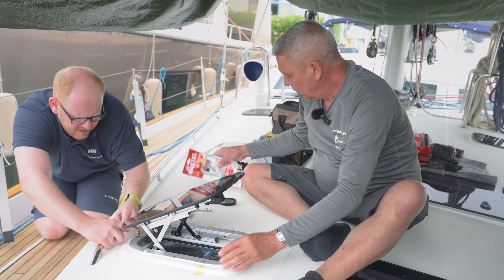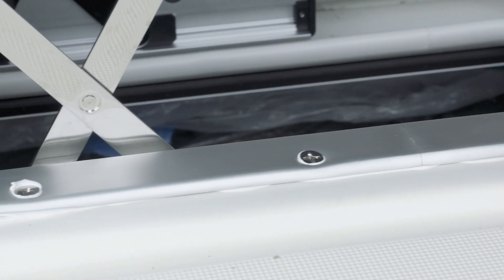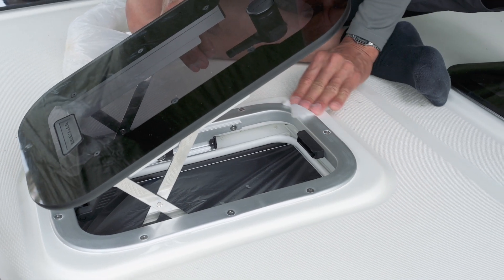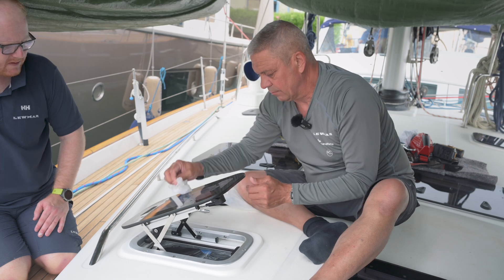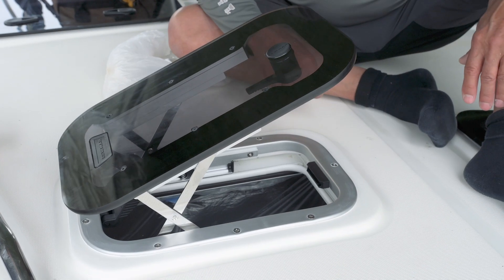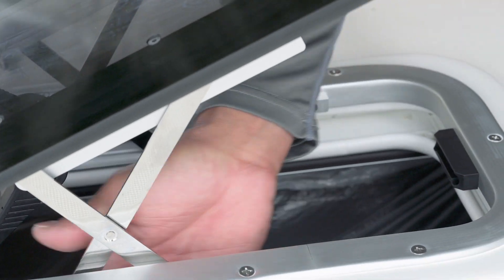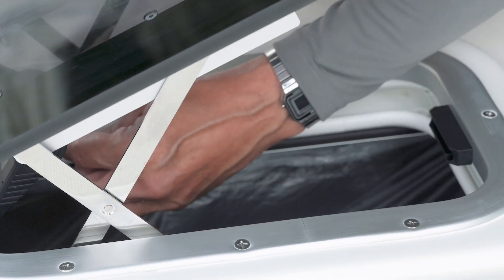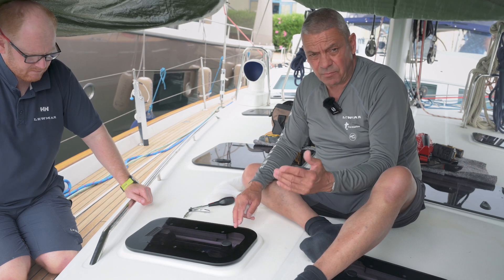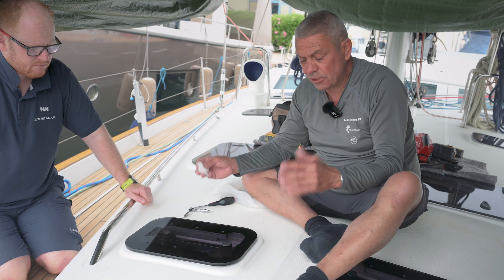Now it's just a case of cleaning up. We're using a generic isopropyl wipe to clean up the excess. You can see that on the screw holes it's oozing out through, which gives you a barrier between the frame and the stainless steel screw. The installation's complete — frame clean-up's good. Check inside, as the hinge that hangs down can sometimes catch the silicone as you go through, so it's prudent to give it a wipe on the base of that hinge. That's the job done. Once you've got to this stage, it's always prudent to lock the hatch, leave it overnight for 12 hours — 24 preferably if you can — just to let everything cure and go off. A short period of time without opening the hatch would be good practice.